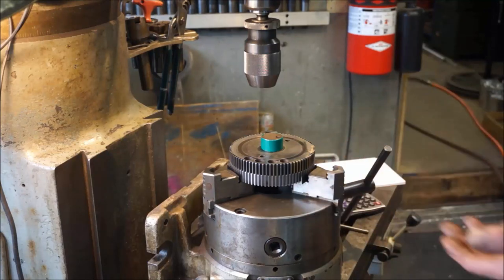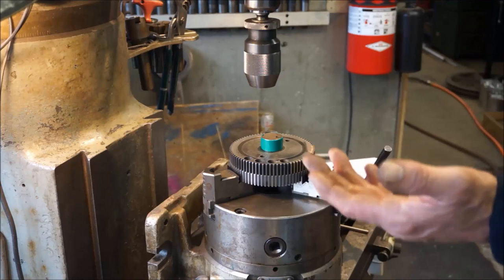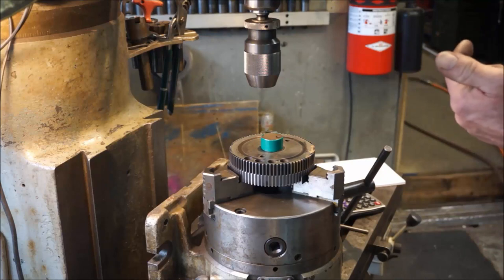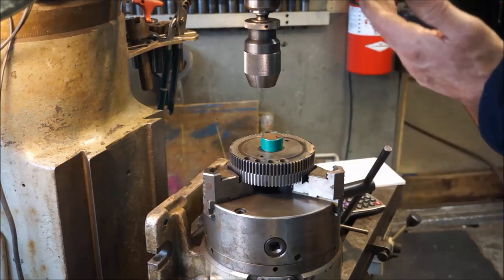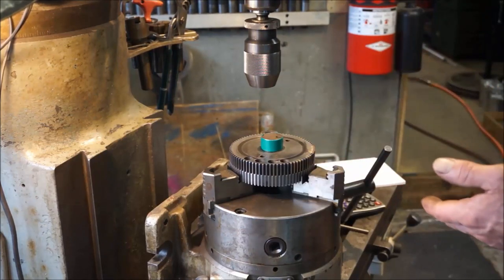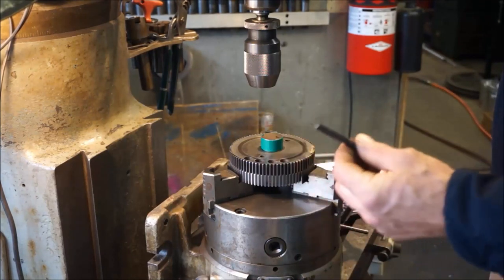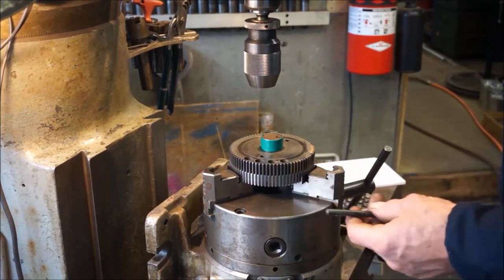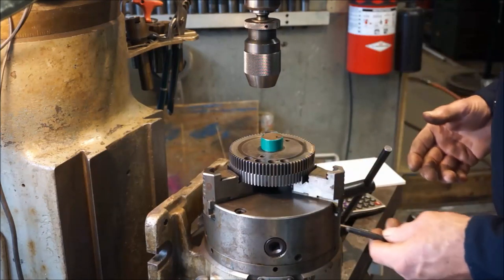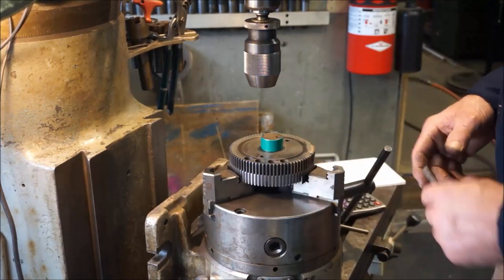Usually if you take something out of tram, as soon as you move it to go back, before you tighten it up for the final, you should go ahead and tram it into your table, have it ready to go. It's kind of a good practice. If you're in a shop where you've done that to a machine and then you're going to go on to something else, you should tram it in and say, hey, I trammed that in, and you check it out for yourself or whatever. And you shouldn't feel bad if somebody else is checking behind you, because that's just good. You never want to come onto a machine without checking that out yourself. If you don't check it, it's your fault. And really, if the guy didn't put it back in there, it's his fault.